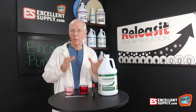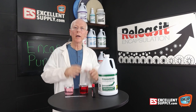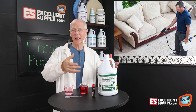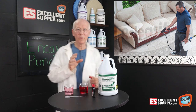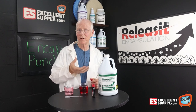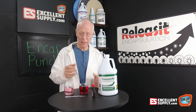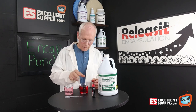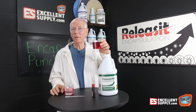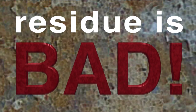So what's the point of this exercise? When we take our pre-spray in a hot water extraction application, we put strong pre-spray onto the carpet with the intention of breaking up the soil, getting it to emulsify and release from the carpet. That's the point of a good pre-spray — it has a lot of solvents, typically a bit of pH to give it some kick, surfactants and builders, and so forth. There are a lot of different ingredients to get in there and get the job done. And then we rinse the carpet. But when we add water to that concoction, we still have a good amount of that strong starter point — one milliliter to eight ounces still leaves an awful lot of chemistry behind.